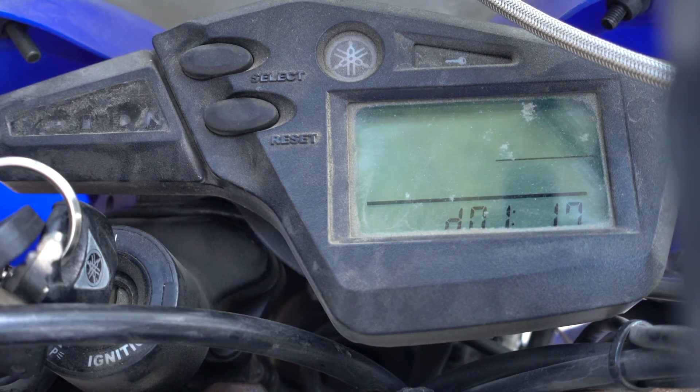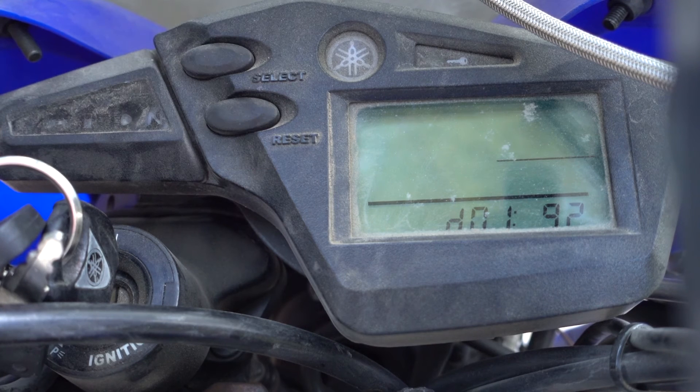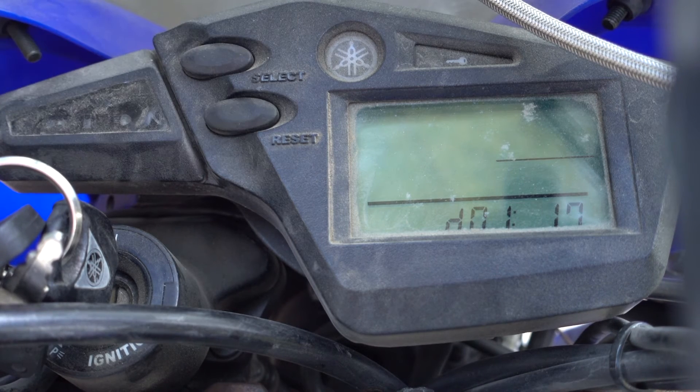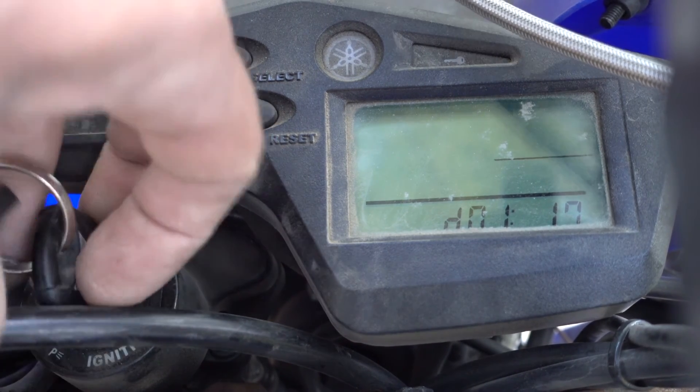D01 is what's reading your TPS — it's showing minus 17. If I open the throttle, it goes all the way to 92. According to the manual, our TPS is out of values going down. Back at 17, it's within values, so it's not causing problems at this moment — but it is within the faulty range of serial numbers and will need to be replaced.